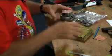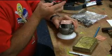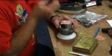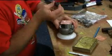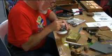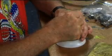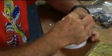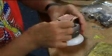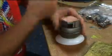The other thing you'll see me often do is this. Now I'm not going to stick it up my nose and draw blood, but just lightly drawing the heel of the tool across my nose, I'm picking up the natural oil from my skin. And that's quite a sufficient lubricant for what we want to do with that cut. And you'll see engravers doing this all the time.